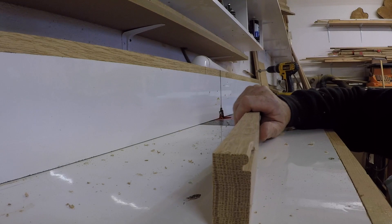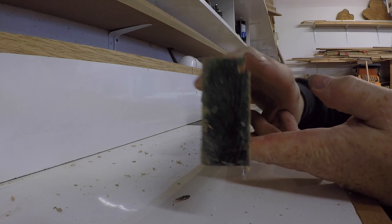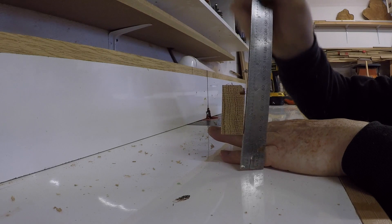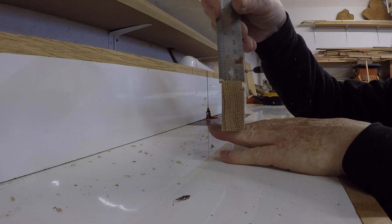That's it there. You can see the bead just catching the round. That's my first attempt — you can see it wasn't high enough, it's still caught in the corner. Notice here it's maybe too close, the bead is stepped in too far. Right up against it there's a wee gap, which means if this is a door or a drawer front, the door would have to be set back there. Of course it's going in too much.